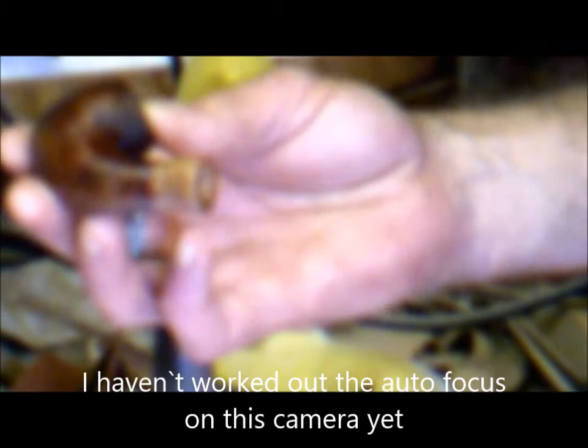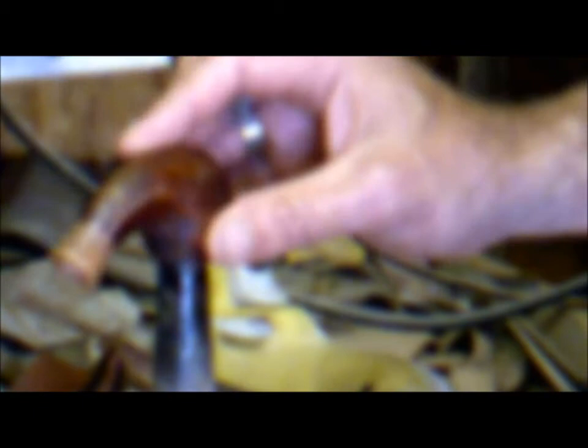Okay, I've given it a bit of stain, and it's had a bit of stain and grain sealer applied. So now what I want to do is just literally take the shine off for now, and to do that I'll use 1000 grit. Let's just go in here. And that'll be a case of just smoothing it out, and then I'll get it lacquered. Let's see if I can find the 1000 grit. And we'll then make the piece for the top, the decorative piece for the top.